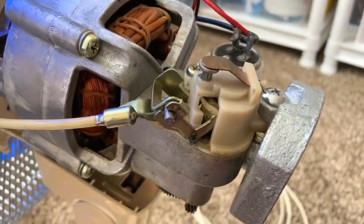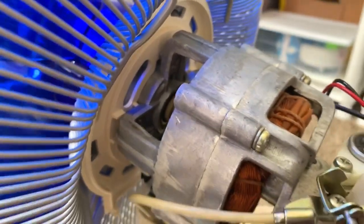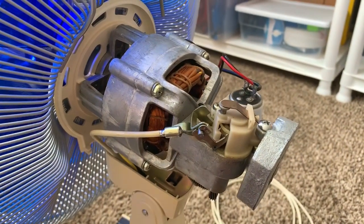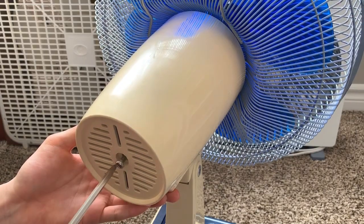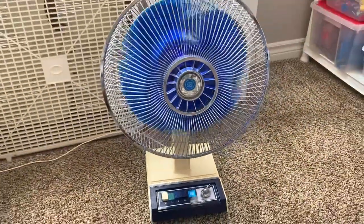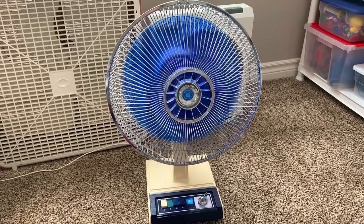It's a really nice piece to have in my collection. Okay, so I just finished oiling it — put some oil down the oil port. For the front I didn't feel like taking the front cover off, so I just oiled the spacer in there and let it soak in a little bit. And now it's time for reassembly. Perfect.